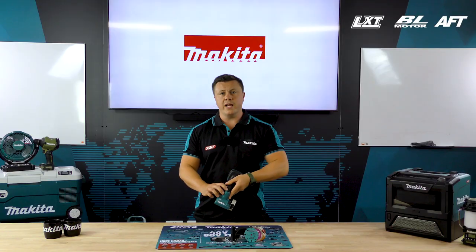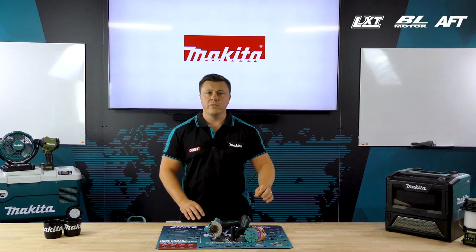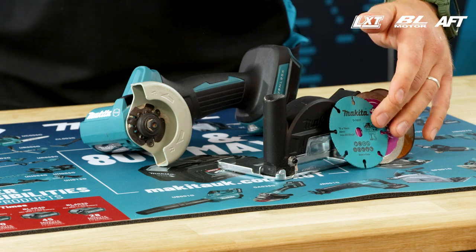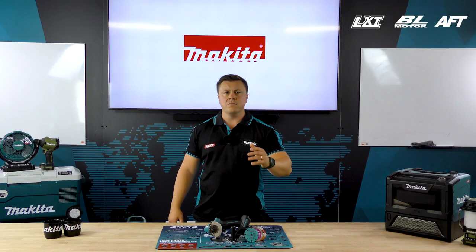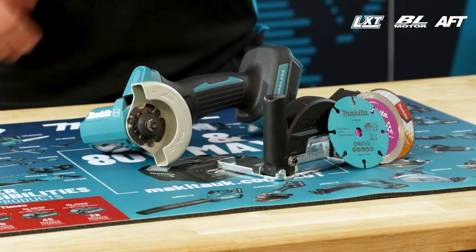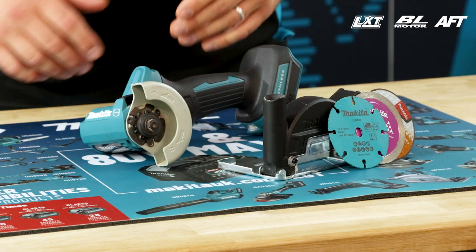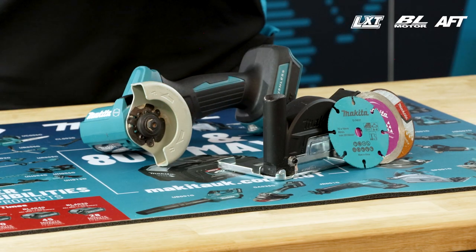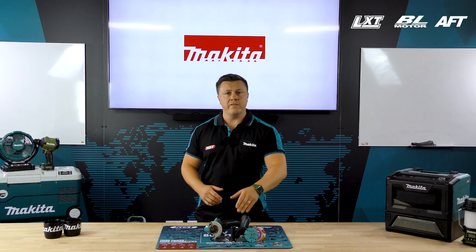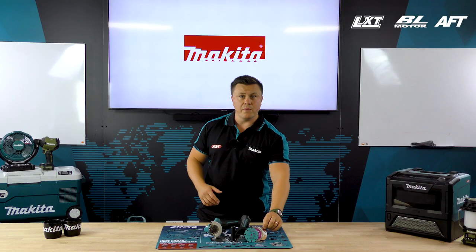In the box we're going to receive some 76mm discs — three here. We have our multi-carbide blade for plaster, ceramic, and fiber boards. We have our continuous rim for tile applications, where our dust guard comes into play — it clips around the original guard, quick release, no need for spanners or allen keys, and perfectly fits on so you can have an M-class dust extractor fitted to the end. And finally, we have our metal cutting disc for metal rod and sheet material.